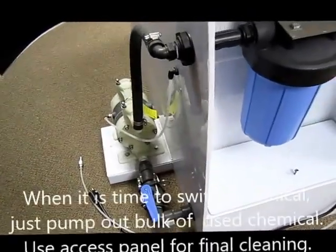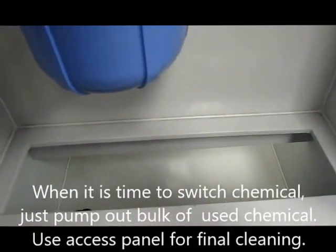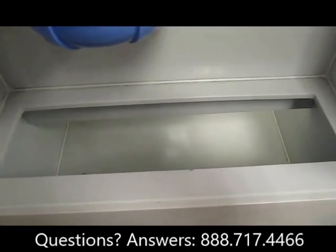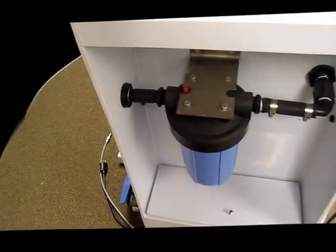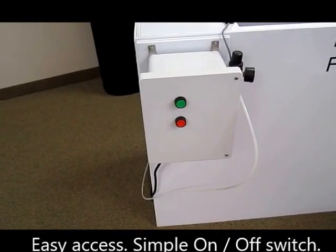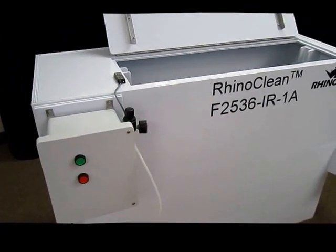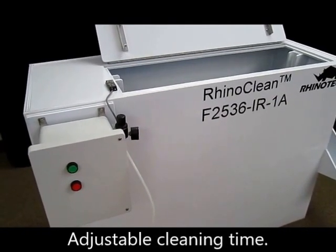As far as cleaning is concerned, there's an access panel right below the blue pump so we can get down into the chamber where all the fluid is, remove it, clean, and then start all over again. Eventually you will have to replace the solvent. So you have easy access, simple machine, easy controls, on-off switch. It's set for three minutes when you get it; however, you can adjust that so it can be lengthened or shortened depending on how well you card the ink out of your screens prior to putting them into the unit.